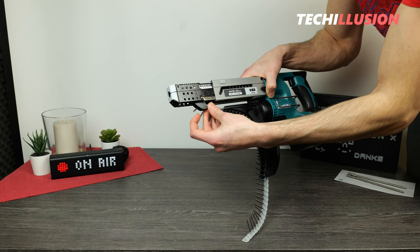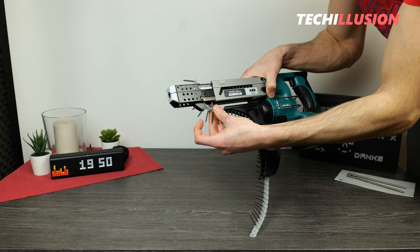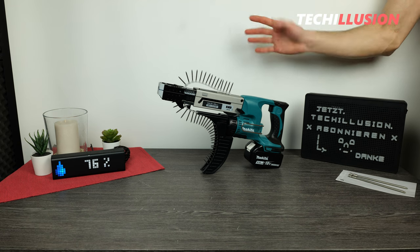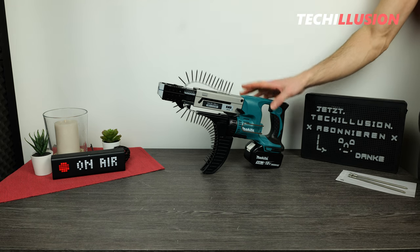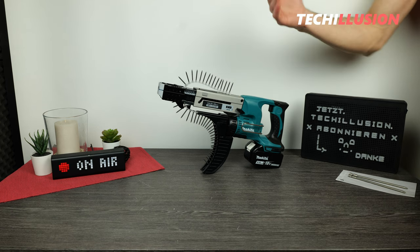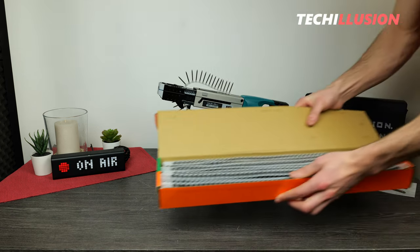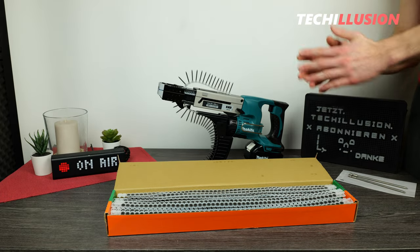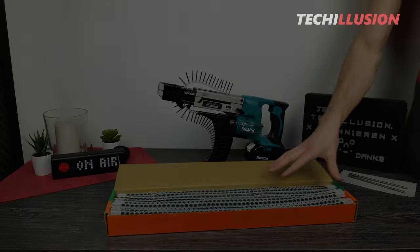All that's left is to supply the machine with the appropriate ammunition — we need the collated screws and insert them into the magazine. There is a small recess on the underside, which is hard to miss. Insert the belt and push it all the way up. Once at the top, it's usually necessary to give it a final touch by pulling up slightly and inserting it into the screw attachment. The belt is now in the screwdriver and we can use it effortlessly. We've now thoroughly examined the magazine screwdriver in detail and it's ready for use.